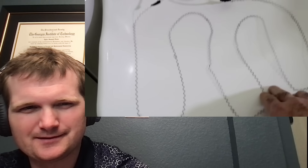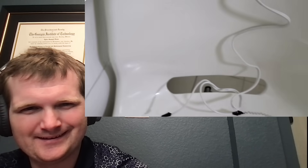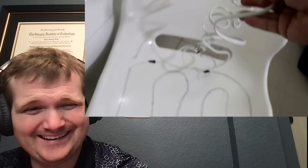He says: 'I hot glued these wires to my seat with their ends connected to a cable where I can just plug into the wall.' It's not covered - there's no insulation, so you're just going to be exposed directly to the heat. How this works is pretty straightforward: heat emission as a function of power, which equals current squared times resistance, or current times voltage. Nichrome wire has relatively high resistance, which makes sense for optimizing power output and heat emission. Though I don't know about sitting directly on top of it.